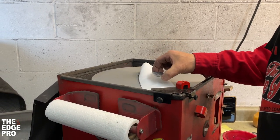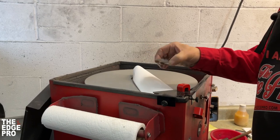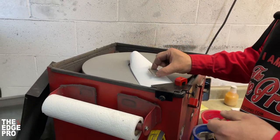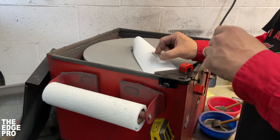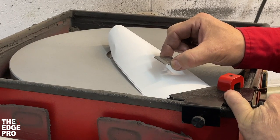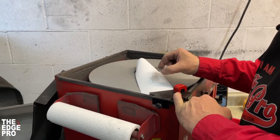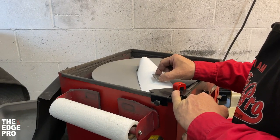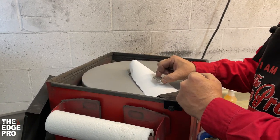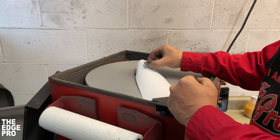There's some engineering tolerance, so it doesn't have to be any one specific spot, but we do need to be in that zone. For a trimmer blade, the component is much smaller and we don't want to use the same pressure — on detachable blades we use about one and a half to one and three quarter pounds, whereas here we're only going to use about a half to three quarter pounds. Under light pressure in the outer zone we'll start losing the outer teeth — it'll feather too quickly. So we move in where there's more crown, and under light pressure we'll still get our hollow grind.